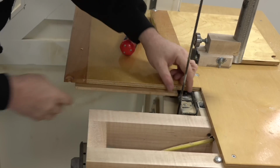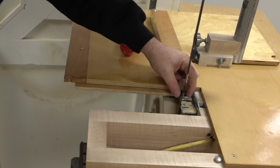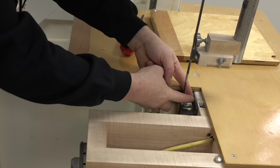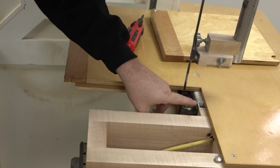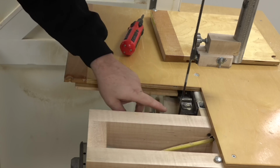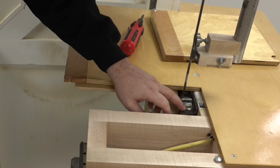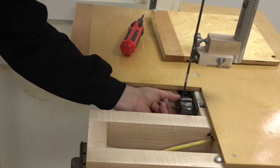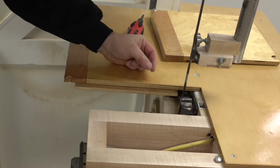and you can see I did the same thing with the lower blade guide. Just blow the dust off, except I oriented them this way. I just cut the top plate off the old holder and put these directly on the bottom plate. The thrust bearing underneath is still in the same orientation. I never changed that at all.